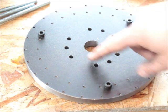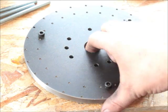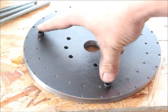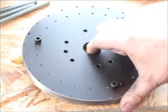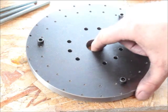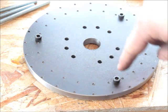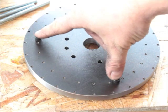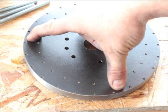I'm going to start with these three bolts right here. They are doing two things: they are holding together the two quarter-inch plates that are on there, so I can make two identical magnet rotors. That is how I grip it in the chuck jaws of the lathe, and that is at exactly six and a quarter inch diameter. These are quarter-twenty-eight hardened allen head bolts and I can grip that on the lathe chuck.